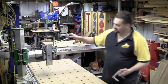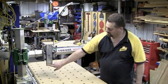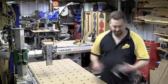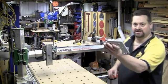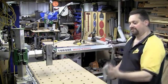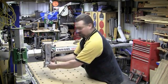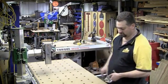They've come up with a standard way of fitting all the tools. At the bottom of this plate, there are three holes. The centre one takes a bolt and the other two take these little pins to stop the tool rotating. This here is one type of router mount. You literally put it on there, put the bolt through from the other side, do it up, and you can mount your router to the Torque Work Centre.